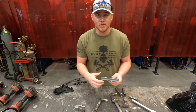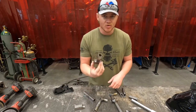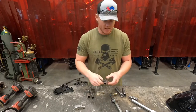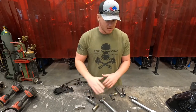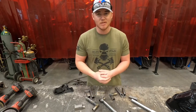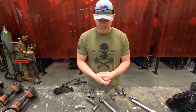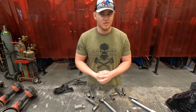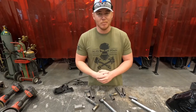You're going to have to do a butt joint, a corner joint, and a T joint all on square tubing, and a corner joint, a butt joint, and a T joint all on round tubing — six in total. These are all great things to practice. A lot of times I would still say practice these before you actually do the weld on your project. It'll save you a lot of headache and the finish will look a lot better. Fit and finish workers in industry do make quite a bit more money per hour than the guys who can just make a pretty bead.